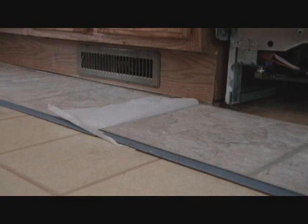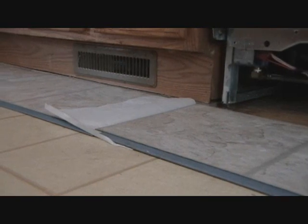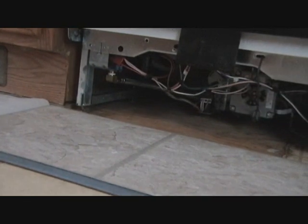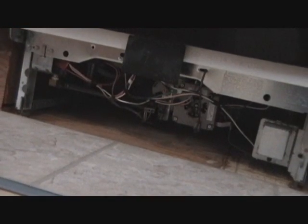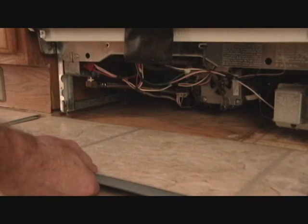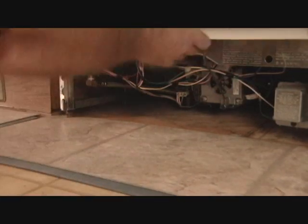I put a piece of paper in between these two seams. It's in between each piece in the package, because I'm just kind of setting that up. That's how the next one will go, and now I'm just going to make my marks. I'll make one there and another one here, and I'll cut this piece like that, slide that in so when the next one goes around it'll match up with the tile lines. And it's time to slide this under. I might only need to go under one. The original vinyl went in about as far.